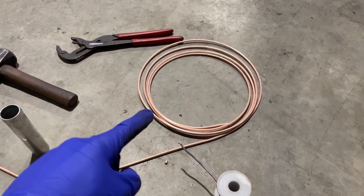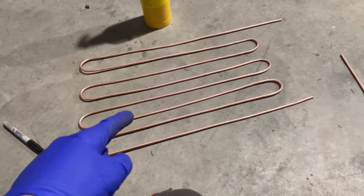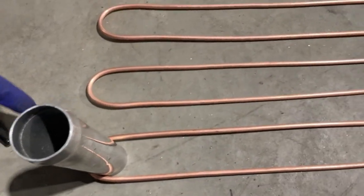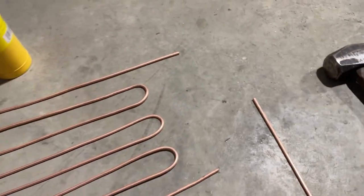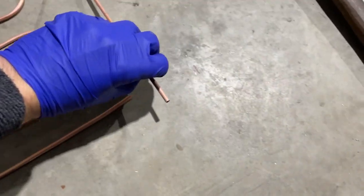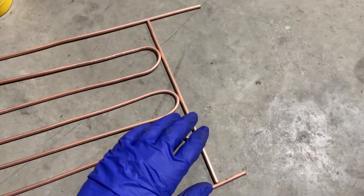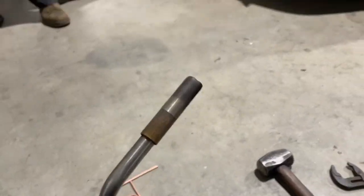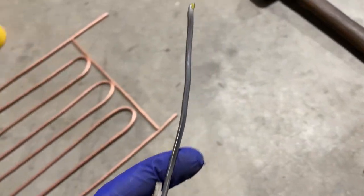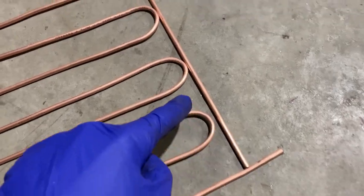The plan is to turn this stuff into this using this little pipe. I've folded the copper around so this is going to be all water-cooled and hopefully keep the laptop cooler. All I'm going to do now is try and put this piece here to make it stronger using some flux and some plumber's solder, and try and connect these together.